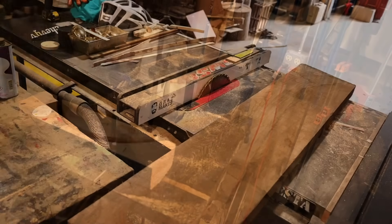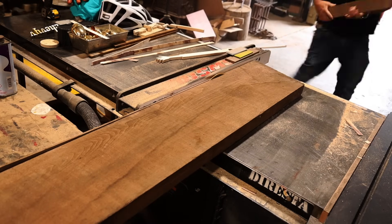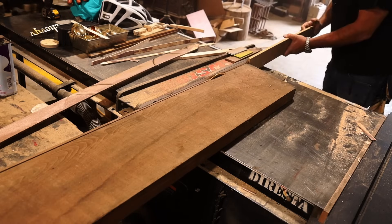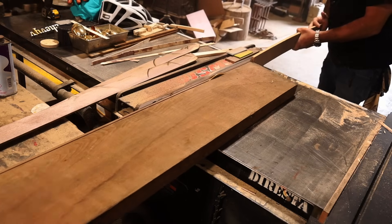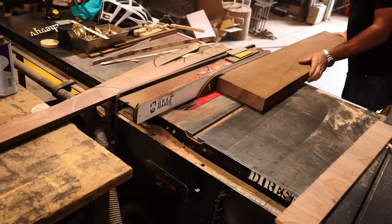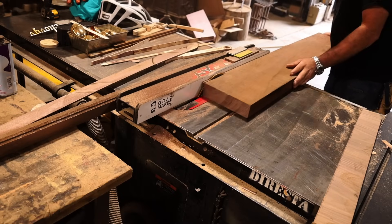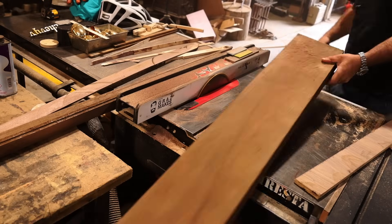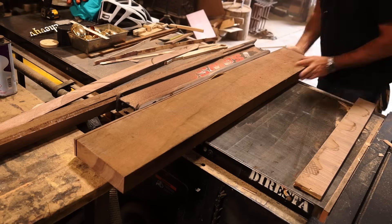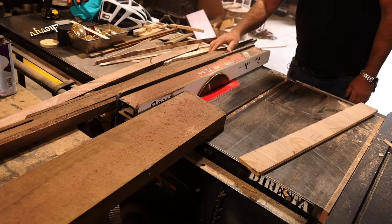Here I made six of them — ultimately I made eight of them so that I was able to prepare all my molds. Now I wanted to bring a little bit of color into it. This is two-inch thick walnut. I didn't have a skinny push stick, so I just used a sacrificial piece of MDF to push that through. I am cutting the slats for what's going to become the bent seat area. I'm going to make eight of these and then eight more of the ash — quarter-inch ash slats. And then we steam each one of those and bend them together. These are pieces left over from a judge's gavel I made on my channel. Two-inch thick — I just cut the sides and ended up with eight of them.